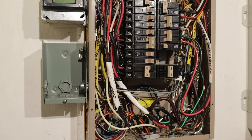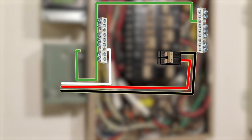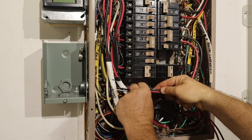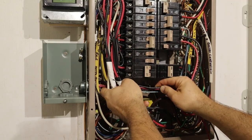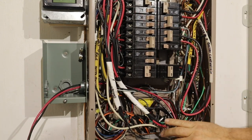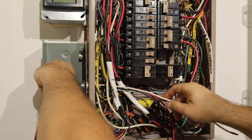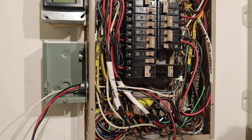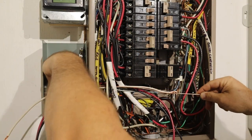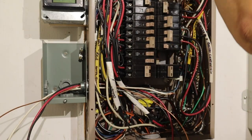There's already quite a few wires in here, so let's use a graphic to make it more clear. The red and black hot wires go to the breaker. The white neutral wire goes to the neutral bus. And the green or copper ground wire goes to the ground bus. Since I just have such a short distance to go, I just push the wires through from the breaker panel into the generator input box. If you have a long distance of conduit, you would tape all four wires together and pull them through with a fish tape.